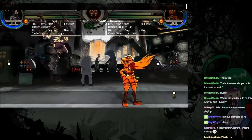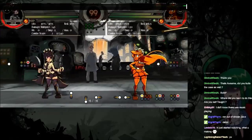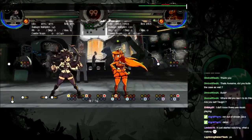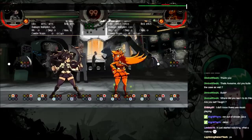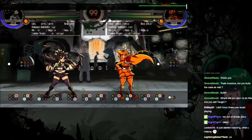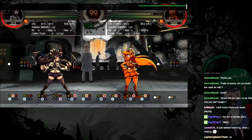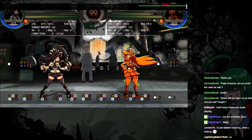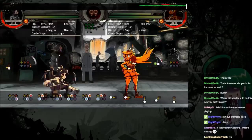So, stick is working. The main 6 buttons and the 2 macro buttons are now aligned as they should be. Start button works, the home button isn't really set to do anything, and the select button is definitely not working. So I just need to check the wiring on that one. That will not take long at all. But aside from that, that is 99% of the stick built.